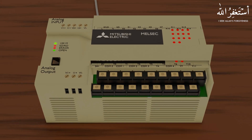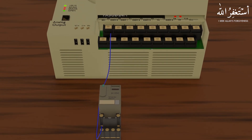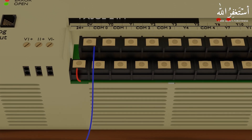Now that we have some understanding of the PLC output terminals and the relay coil, let's see how to hook a relay with the PLC. First, we will connect a wire to the A2 terminal and hook this wire at the zero volt terminal of the PLC — so the DC zero volts are connected to the A2 terminal. Next, we will connect 24 volt DC to the Common 0 terminal with a small wire loop.